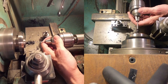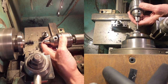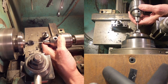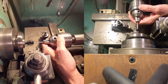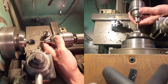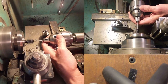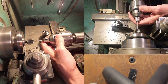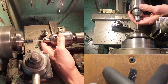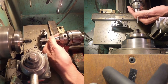Too hot would be hot enough to turn the resins in the wood into a kind of a hot plastic. And that would be bad because it would build up, get big, lean on the tool, and push it off center, which is the whole reason that we're using this drill, is to try and stay on center and drill a nice straight hole. Now this is an ambitious thing to do in any material